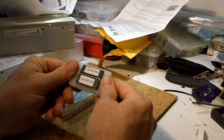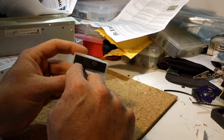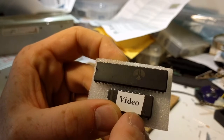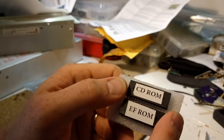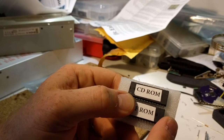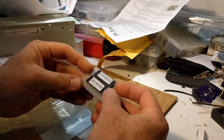It comes with four chips in this nice little package. This long one here is the 65C02. There's a ROM chip labeled Video, and two ROM chips labeled EF and CD. That's the depth of the Enhancement Kit — it's four chips that you slot in on the logic board.